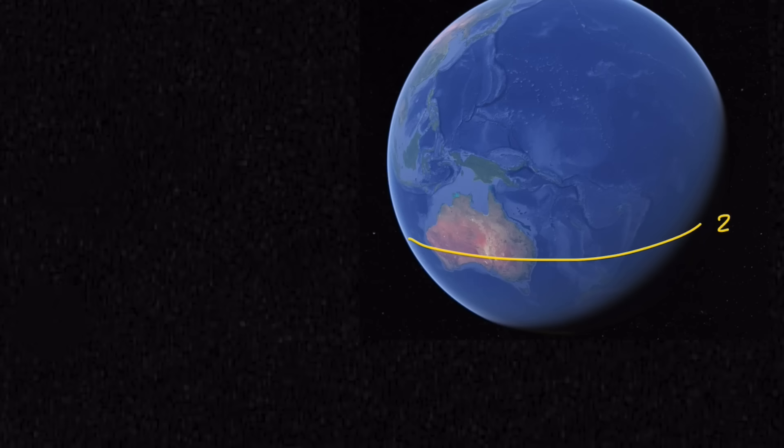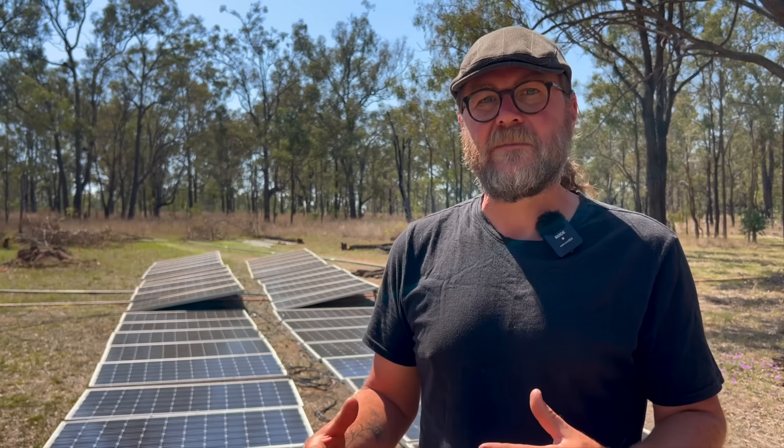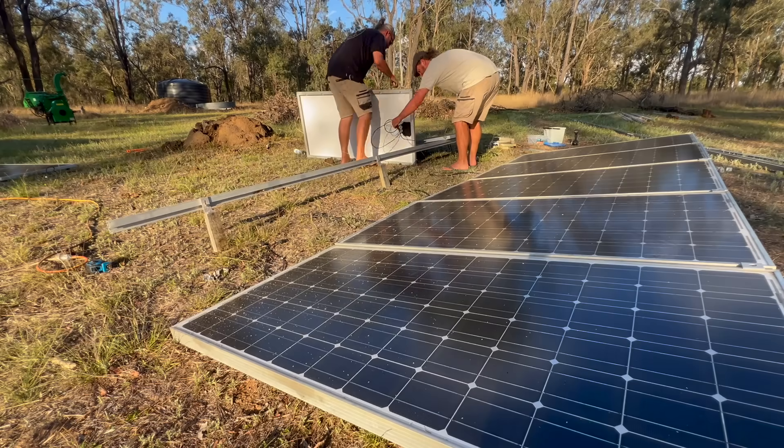Here's how to get around it. For a fixed angle all year round, you basically use your latitude. Ours is 27 degrees, so I could set my solar panels at 27 degrees and get a pretty even amount of sunlight year-round. But to optimize further, you can pick three different angles: autumn and spring use your latitude angle (27° for us); for summer, go minus 15 degrees — so my summer angle is about 12 degrees, which is almost flat; and for winter, go plus 15 degrees — giving a winter angle of 42 degrees. Right now about half the panels are still laying flat while we make new legs to pop that angle up to 12 degrees.